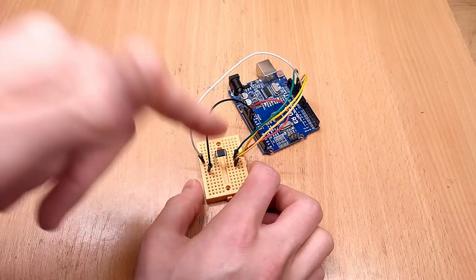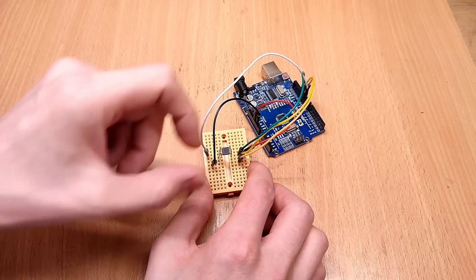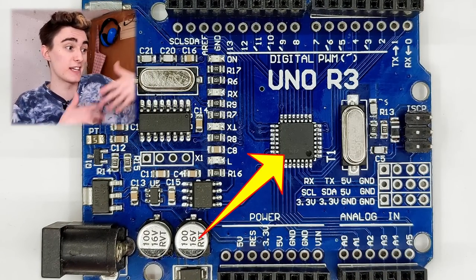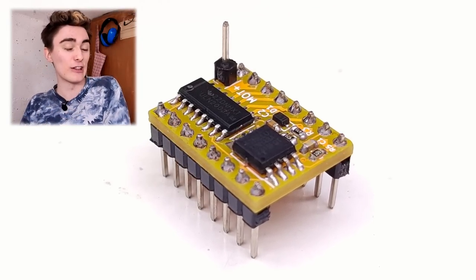At this point nothing will work yet, because the chip resets every single time we send in a step pulse. So we need to remove that reset functionality before my code has access to that pin as an input. We know a microcontroller can be configured for many different use cases. You can imagine it like a room: put in a couch and a TV and you have a living room; put in a bed and a closet, you get a bedroom. On the AVR family of MCUs, the only thing defining which configuration is used is three hexadecimal numbers called fuses, stored somewhere in flash memory.